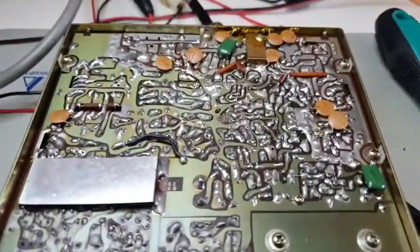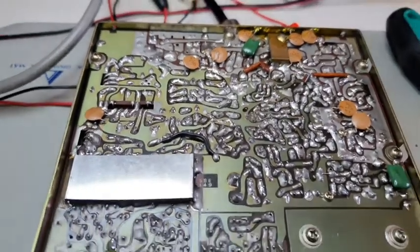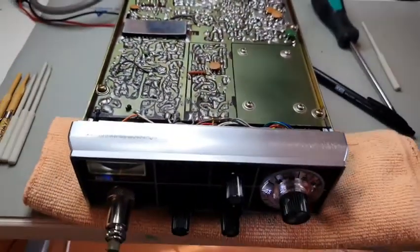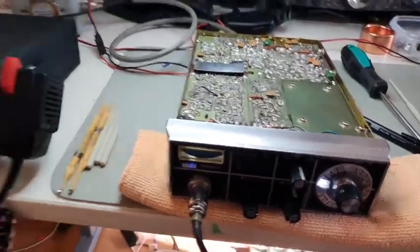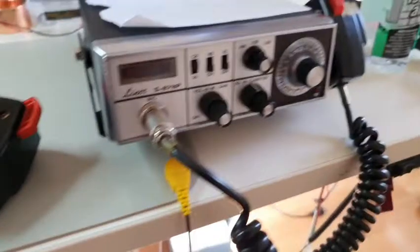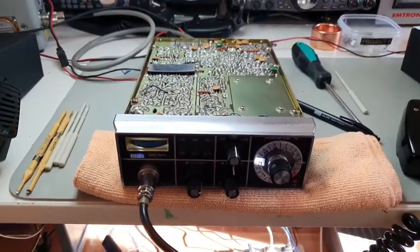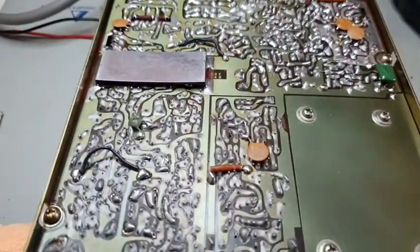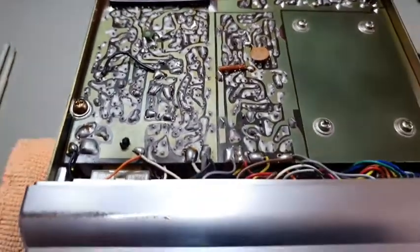The process from here is a process of elimination. You start on a small area — I work under the magnifying glass — and remove the solder on one pad at a time in different areas, then apply fresh solder. I do that until the radio becomes stable. That's how we fixed this one and two others that I have. It's not as scary as it sounds.